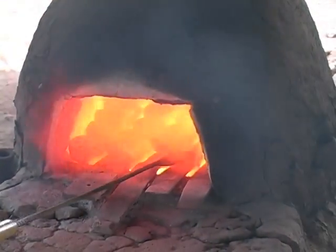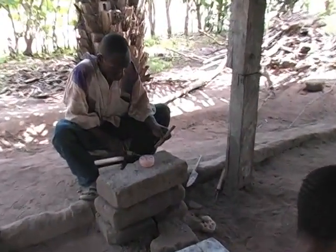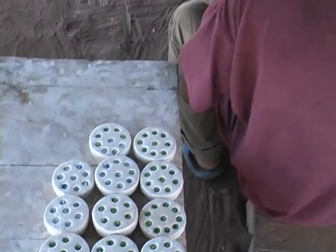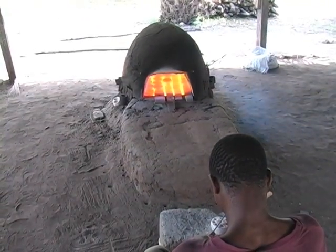This one is ready for firing. It takes 20 to 35 minutes at 600 to 800 degrees Celsius. The translucent one takes 30 to 45 minutes at 800 to 1000 degrees Celsius. Now we can go to the firing side and see how hot the kiln is.